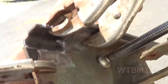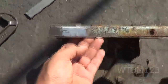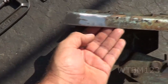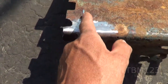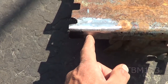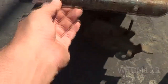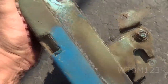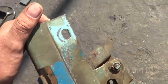What I'll probably do first is tack weld it up here, then do a little bit under here. Got that piece welded in there — it's not perfect but it's close enough. I put a blue mark up here that's about where that bolt was. Still got to drill one hole in it about in the same location. This side's even a little slotted so I could do that if necessary.